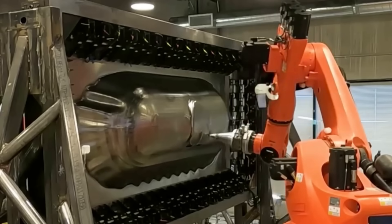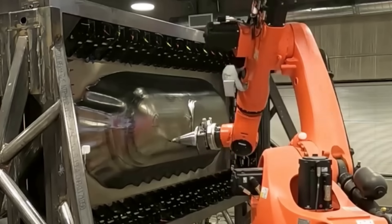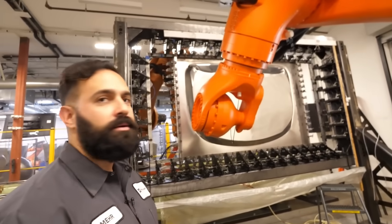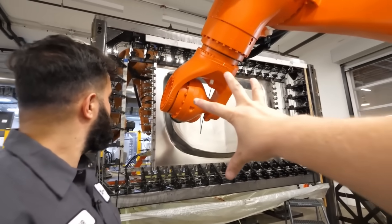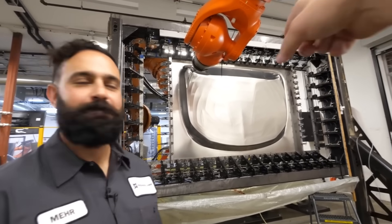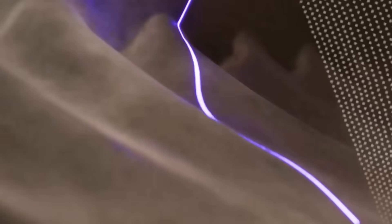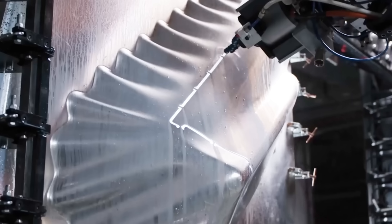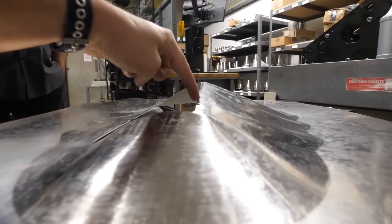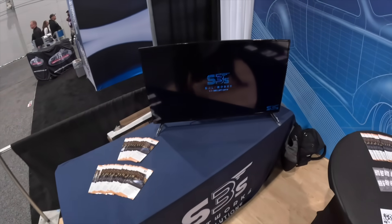As you push that panel in more and more, the tension on that piece of sheet metal is going to increase, which means once you unclamp it and cut it there's going to be a spring back. Some companies have figured out what that spring back is, but if you use two stylus or forming tools on these robot arms, then you can make a hood or any panel you can think of. Then you can go cut it out with a laser or a mill and it's all in one machine. The Figure machine doesn't actually cut it out — you pull it out and have to hand cut it — but some of the more advanced machines will scan the surface, get the best fit, and cut the part out all in one, so it's a hundred percent accurate.